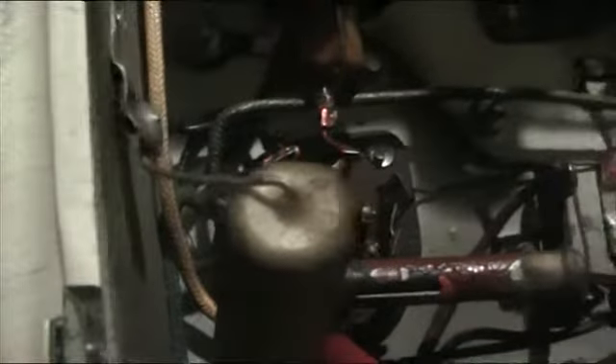The other side — it might be a 51k or something. Let's see if it's in any realm of that. I'm not quite 100% sure how to read those resistors, but it's reading 18k. It might need replacing if I can figure out what the value was supposed to be.